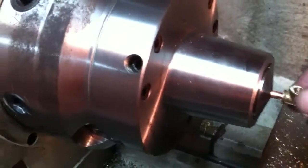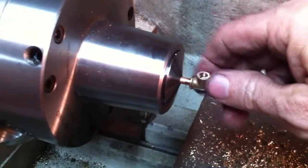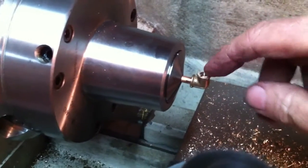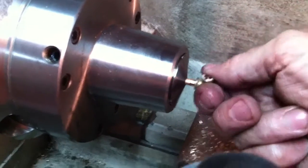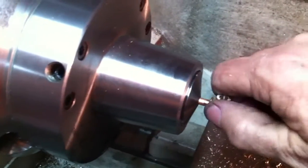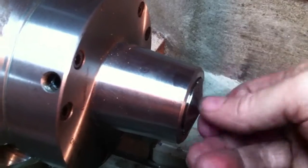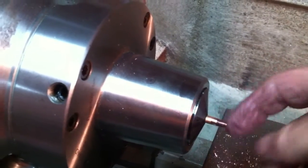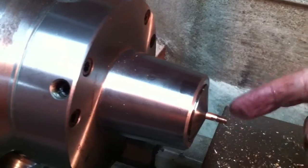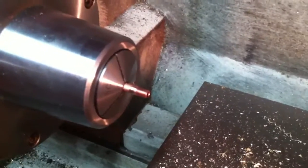The first thing I wanted to show was I threaded the copper pipe for the blower line, and I'm going to silver solder the fitting into this side of it. But as you can see, let me gently take that off — I put the 3/16 inch by 40 model taper pipe thread on there, and there it looks a little bit better shot.